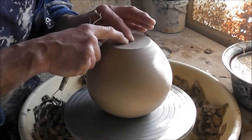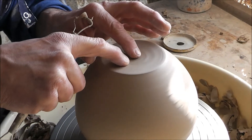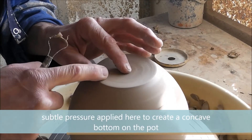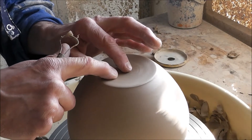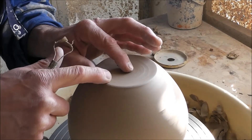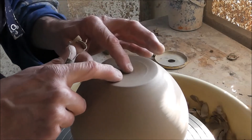I always make the bottoms of the teapots go a bit to the inside. The reason for that is when the teapot stands on the stove and the lid of the stove is not completely even, then it will still stand on it securely and will not wobble around.